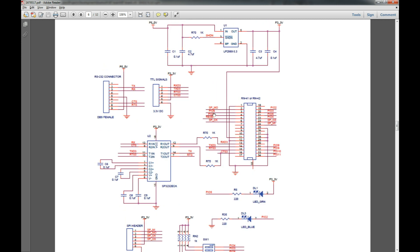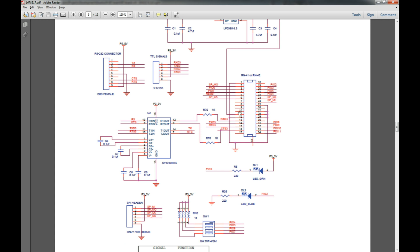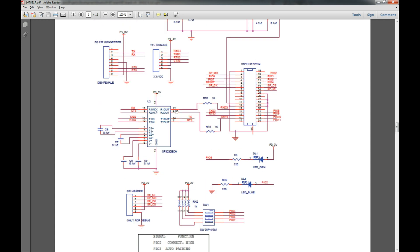I'm going to walk you through it real quick. They've got some power here — looks like they're taking five volts in and regulating it to three volts to power this thing. They've got some peripheral stuff, an RS-232 connector, and some headers bringing pins out. Here's the main chip, laid out almost like an IC. For this demo, I'll be doing just the RS-232 side of things. Leave me some comments if you'd like to see how the USB side works, but for right now we're just doing serial communication via Bluetooth.